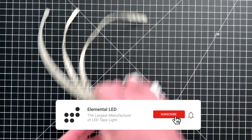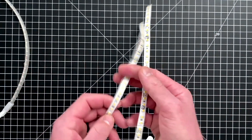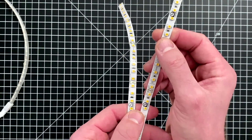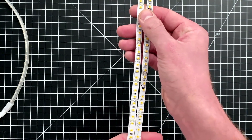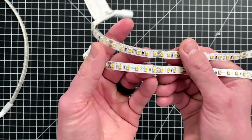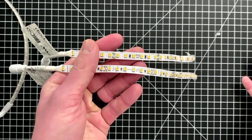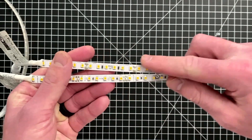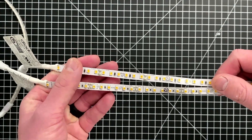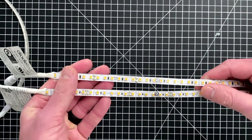Let's take a look at them up close. I have the Blaze on my right and the Blaze X on my left — both at the 200 lumen level. This is a standard pitch tape light, as we call it, versus our Valant, Valant X, or Celeste, which are 72 diodes per foot — a tight pitch. As long as you use a good channel profile, you're not going to get dotting down onto the tile or reflective surface.